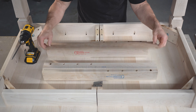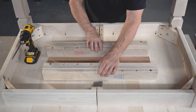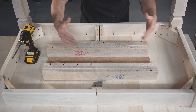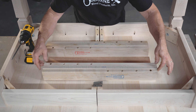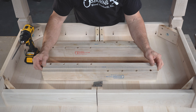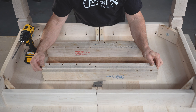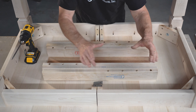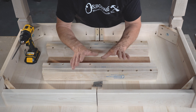I'm going to take just a scrap piece of wood that I've cut and drop it down in there, and I'll use that to push this up against just to make sure that these are perfectly parallel. This is completely together, and what I'm going to do is spread that ever so slightly — a good eighth, maybe even a quarter inch. The reason being, if these tops were to shrink just slightly, it would still be able to close completely.